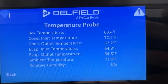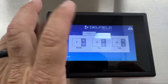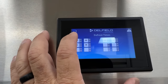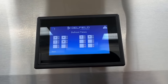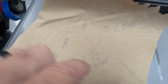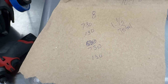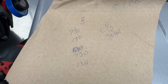We're checking out our probes — looks like we're pretty close. He did say we actually have six of them. We just set the time and date. So there's the time — let's go into our defrost type. I want time of day so we make sure we do it when they're not busy. They said they're busy between 10 o'clock and one o'clock. Defrosting lasts a half hour to 45 minutes and they said it takes about a half hour to pull down. We've got a time change at the end of the year, so I'm going to go 7:30 — that'll give us six hours before 1:30. This has an automatic defrost but I don't trust it because I know what a problem that can be. I'm just going to change it to be safe because I've fixed a lot of problems with it.